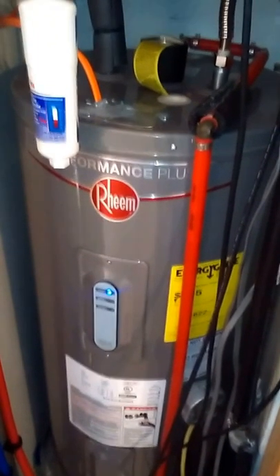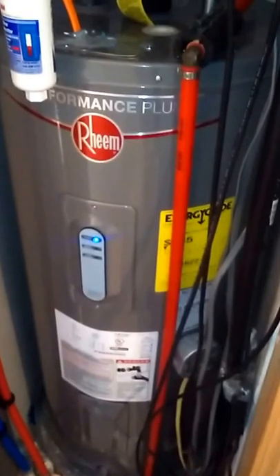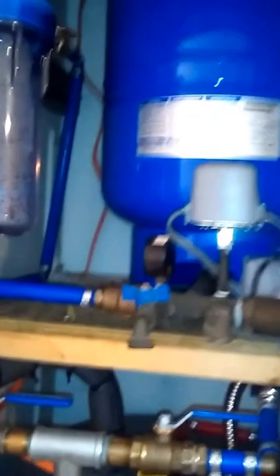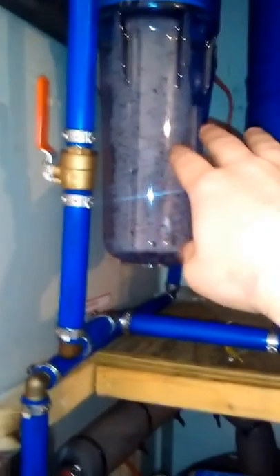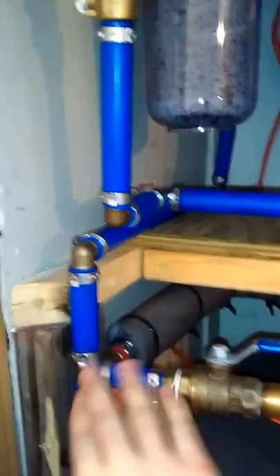The manufactured house water heaters are generally lower quality and they're a bit expensive, so this is the medium quality one from Home Depot. I'm on a well, so I built a shelf here for a 20-gallon pressure tank. The water comes in from the well, goes through the pressure tank, comes out up through a whole-house sediment filter because the water on my well is a bit dirty.